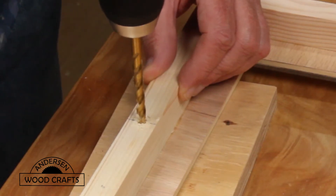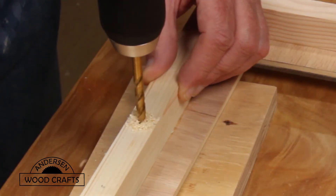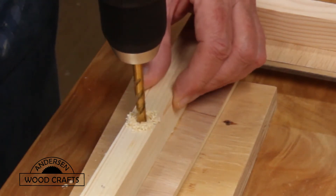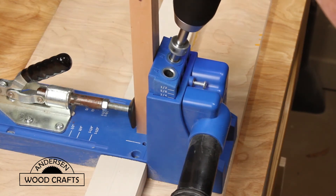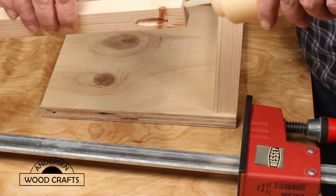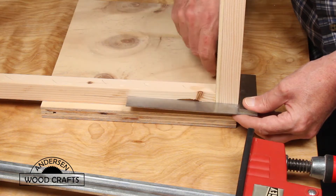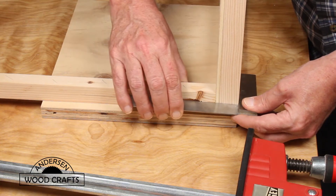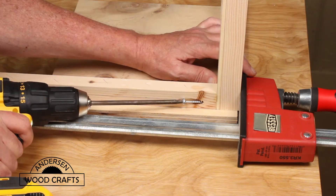In order to secure the filters into the frames, I'm drilling a hole for a bolt to put a latch on. Now I said most of this project is just glue, but there will be four screws and the pocket hole screws. This is on the cross pieces that will attach to two smaller frames. Make sure it's nice and square and then apply clamp pressure before you drive the pocket hole screw in.